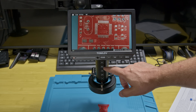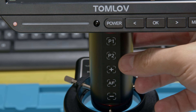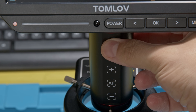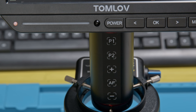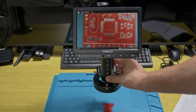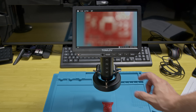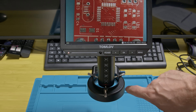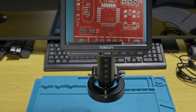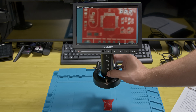The P1 and P2 buttons are for focal presets. When you're focused, you simply long press one of them and it will store that focal length in the memory. Let's defocus the microscope so we can test our preset — okay, that's definitely out of focus. Pressing P1, and it snaps straight back to focus without hunting for autofocus. There are also manual focus buttons which work well for fine tuning.